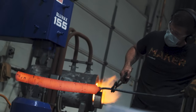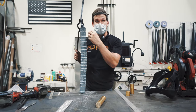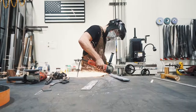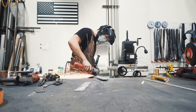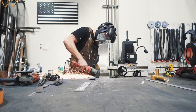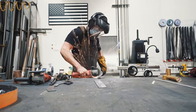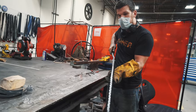This is 64-layer Damascus steel. I need to cut in my ladder pattern. The first time I did this sword, the ladder was a little more spread out and the billet got more drawn out, so the ladders didn't really show. This time I'm going to have a tighter pattern. Once these cuts are in, I'm going to hammer this down to about half the thickness and then my jacket will be done.